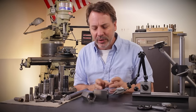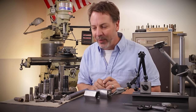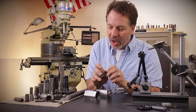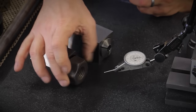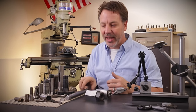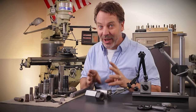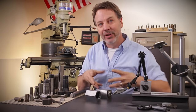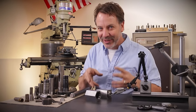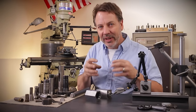With a collet block, there are basically two designs: you have a square and you have a hexagonal. Think about nuts and bolts — if you need to make a square head or a square nut, you would use a collet block. Also hexagonal. You can set that up over on the milling machine, and I'll show you a little bit later how to cut a hexagonal shape quickly and easily without a lot of complication. I try to find the simplest, fastest way of doing something that is easy to teach and easy to retain.